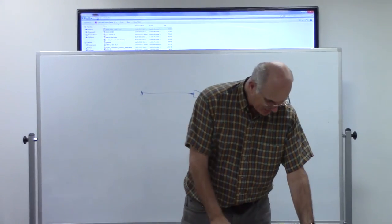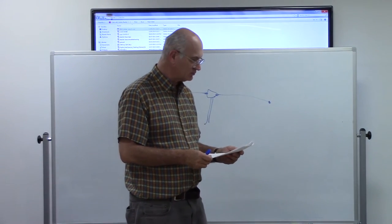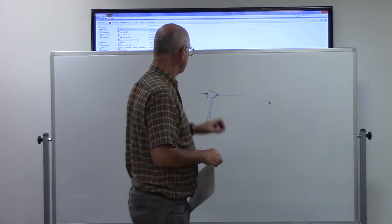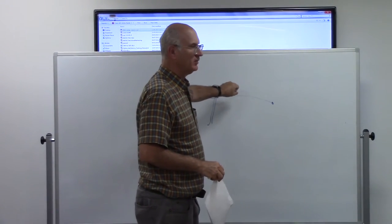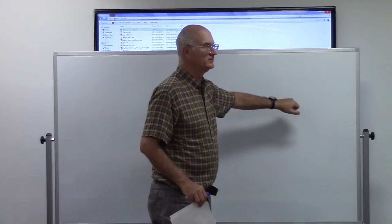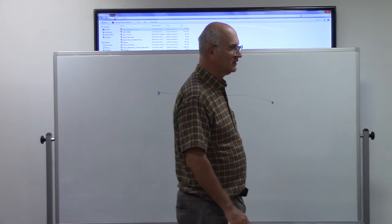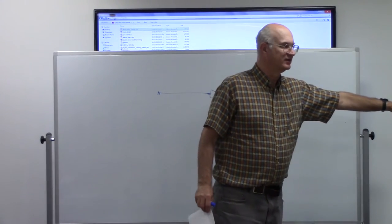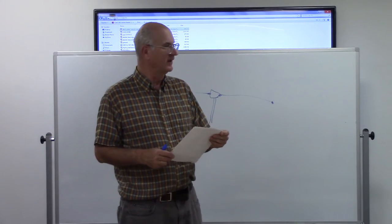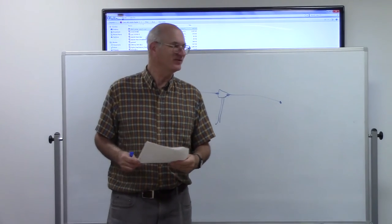So that's an important thing to know for safety. For that, you don't have to touch both ends of the instrument. Grab any point here, and you're going to get an RF current going through you. It's going to get more severe. Oh, okay, so it's an RF burn. It's not like getting the discharge of a shock. No, it's going to be an RF burn. It's going to be like putting your hands in the microwave. It's going to burn. I feel like something's hot. So it's common sense. So don't do it.